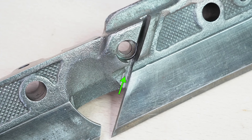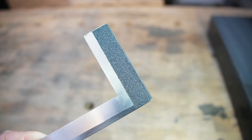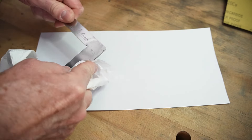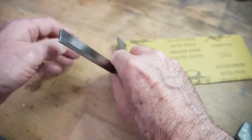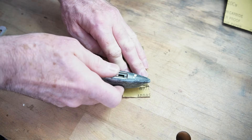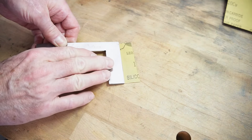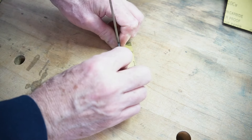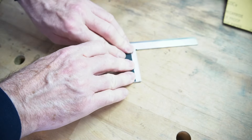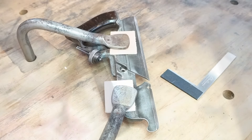But this means I can't use this cutter as a tool because its edge won't touch the surface in there, so I need something with a square edge. I found this — my friend Dorothy gave me this around 30 years ago and it was made by her late father. I'm going to use it as a tool to carry a piece of abrasive paper, so first I'll clean it with some meths, then I'll cut some 120 grit paper, spray it with adhesive, and wrap it on.